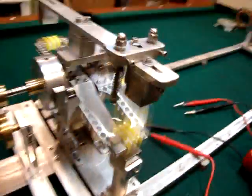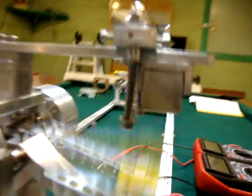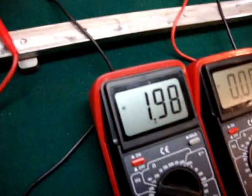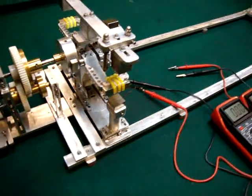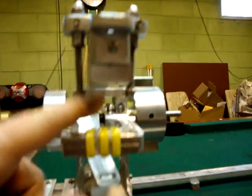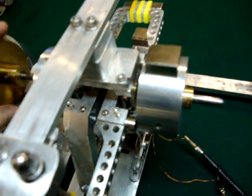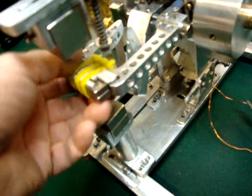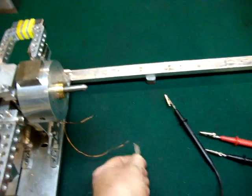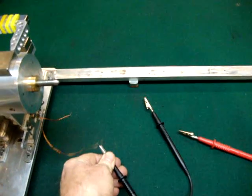Almost two volts right here. I'm getting two volts — I increased it from 1.8 to 2. These springs up here keep the orbit from slamming into the magnet. I put some stronger magnets down inside there; when it comes around and hits, it reacts more. I also extended this out a little bit further and put some stronger magnets inside.